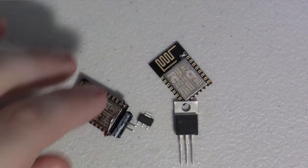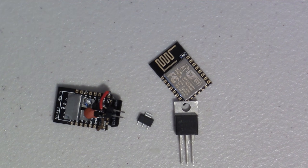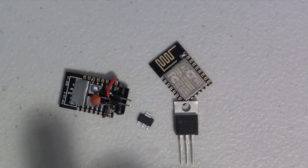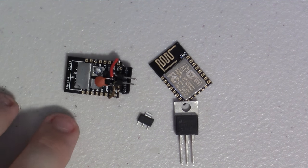What I found was that with the AMS1117, which is kind of hidden underneath this cap here, when I pumped 12 volts into them they would work for about two minutes. As you might expect, with the AMS1117 being a linear regulator, this little heat sink I added would get pretty hot. When you pump 12 volts into these for more than about a minute or two, they heat up and the voltage that comes out starts just going all over the place.